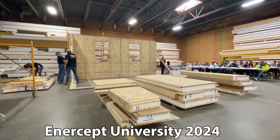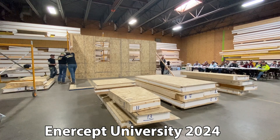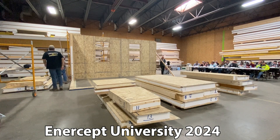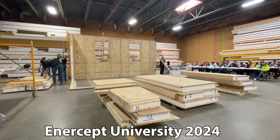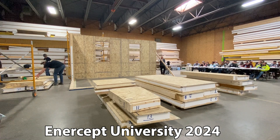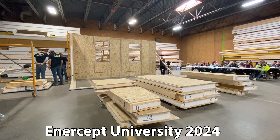Our four-foot line is different — all of the narrow four-foot material, the OSB, is pre-cut on a machine called the Ansrud. Each piece of OSB is pre-cut — there are obviously two pieces, the inside and outside, and the foam associated with that. As it's run through the four-foot line, they're able to put individual additional materials into the panel. So if you wanted a foundation panel or a basement panel with studs spaced at 16 or 24 inches on center, it comes down the four-foot line so we can put in the additional lumber acting as structure, and then it gets sandwiched together and run through the press.